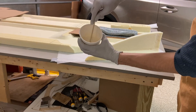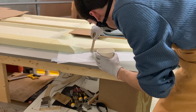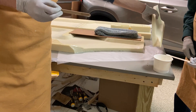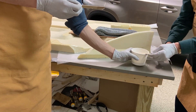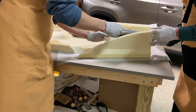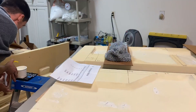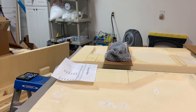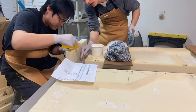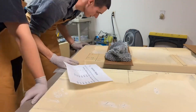With about a month of work wasted and now having to be redone, I got back to work and sanded down the broken section, added some new epoxy and micro balloons, reattached that, and then cut out a new section to add to the front. The moral of the story is just be very, very careful. Take your time, make sure things are square, make sure you're doing it the right way. Holding the sanding block upright by eye was a fast method, but on something like this it needs to be precise. This is where many measurements are made from — they have to be exact. And if you do mess up, add the filler material properly. Use wax paper. Do not try out a new method on the airplane — test it on a scrap piece first. It adds time and wastes epoxy, which is expensive, but it is not worth the expense and time of replacing such a large piece.